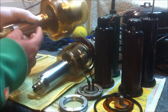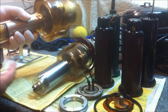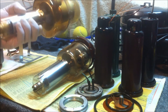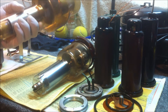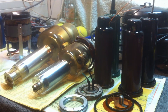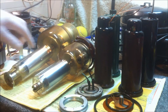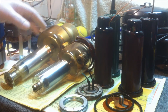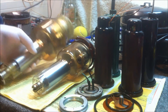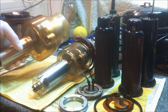It's pretty massive — it's a rotating anode. This thing actually rotates, spinning that tungsten target on the top at about 10,000 RPM, maybe even more. You can see they've drilled it out to get it all balanced and working smoothly to minimise heat in the actual tube itself and prolong its life. That anode actually sat inside this winding, which would be pulsed with either pulsed DC or AC, causing this assembly to rotate and allowing more energy to be emitted from the surface of that tungsten target. You can see the glass window here — that's where most of the x-rays would be shooting out.